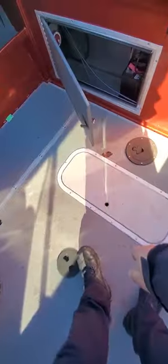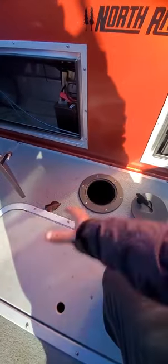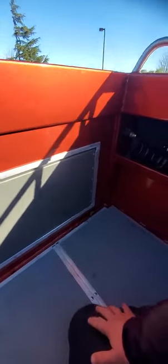The fuel tank's up underneath there. You got a fish box here — to fill that up, if you go into here you'll see a valve way back in there. If it's open, water can come in and go out as you go. If you close it, no water will come in. You can let as much water as you want and then close that valve. You got dual batteries, shut-off switch, Yamaha 10 micron — I already primed it up. Change that once a year, no matter what. Stick with Yamaha — once a year replace that. Change your oil once a year and you shouldn't have an issue.